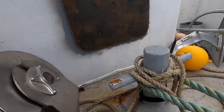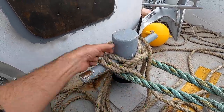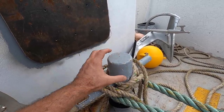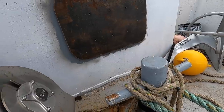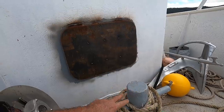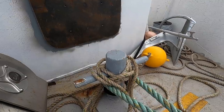What we're going to do is put the anchor winch back on. A few people mentioned about maybe shortening the Samson post that the mooring goes on, rather than raising the winch up - keep everything nice and low. I think it's a good option. We can definitely take 50mm out of the base and probably 40mm off the top and recap it.